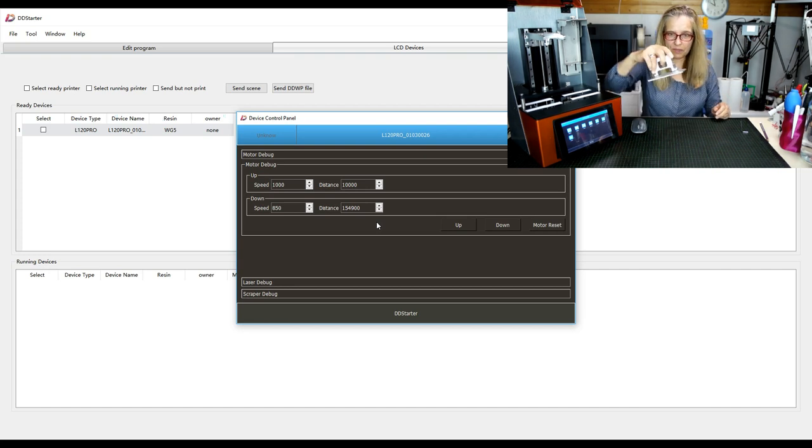So this is now the build plate that I have. I will open up the screws, because I'm not happy with my bed at the moment. On one side the base layer is always a little bit thinner, and thicker on the other. So I want to re-level it. And I thought I'd just make a film about it.